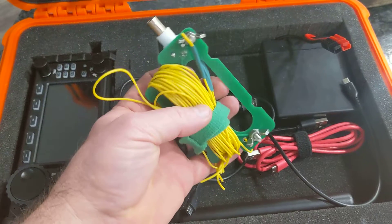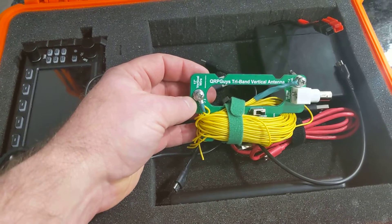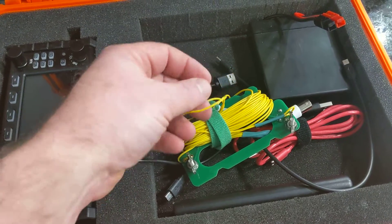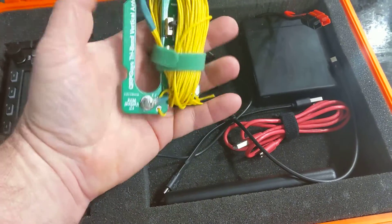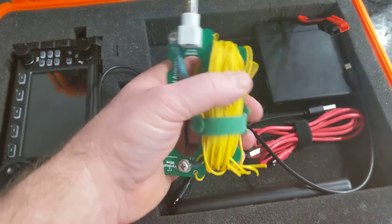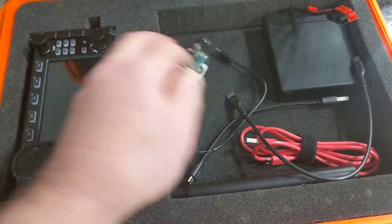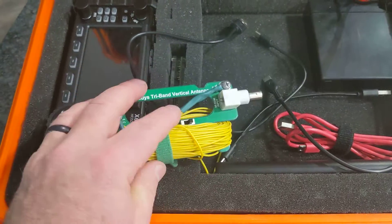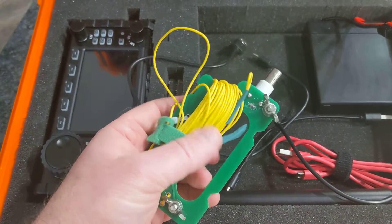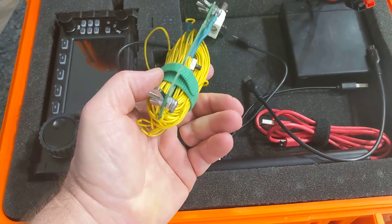Antenna-wise, I've got the QRP tri-band antenna — it covers 20, 30, and 40 meters and works really well. It comes in a kit for about 20 bucks and takes about 15 minutes to solder up. I'm not an expert solderer and it was really easy. I bought 26-gauge flexible wire from Amazon — it doesn't hold a crease so it lays out really well. Peak power on it is 20 watts, and the Xiegu is only 10, so no worries there. The Xiegu has a built-in tuner, and once you get this antenna tuned and adjust the toroids a little, you won't even need the tuner. It's 17 feet with five radials.